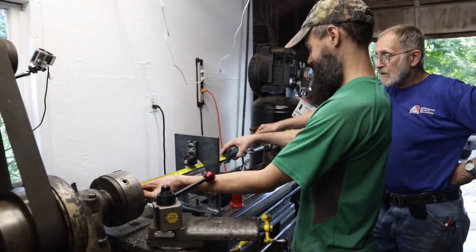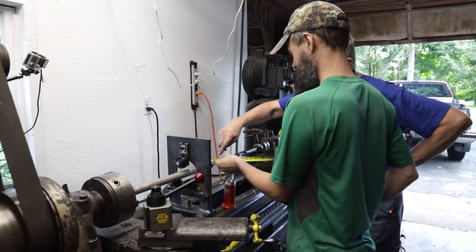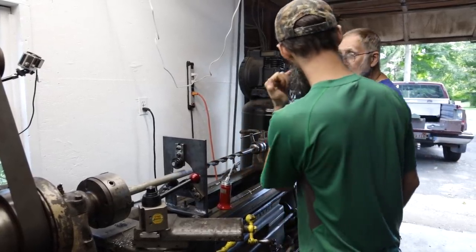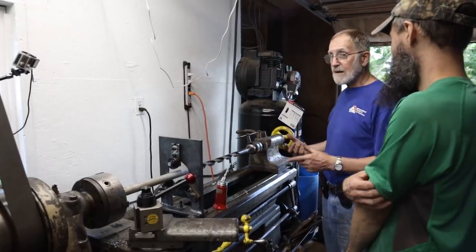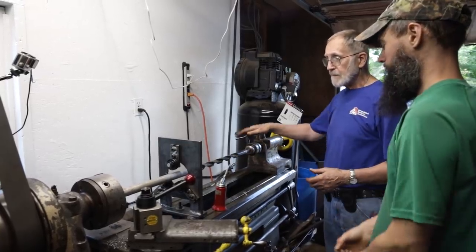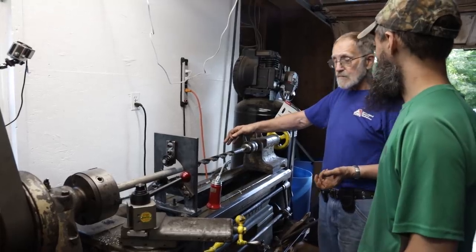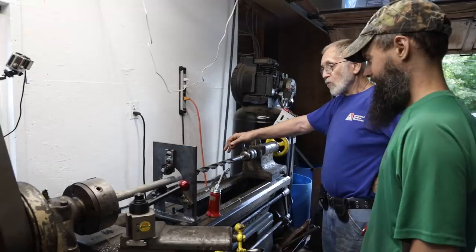Now, the fun part comes. When you go in with a drill like this, you only got 6 inches of travel. So you can drill in 6 inches. And in the meantime, you got to be pulling out to clear everything. And one of the issues with Delrin is it gets hot. So we have to find some way of cooling it.